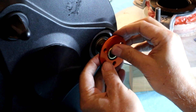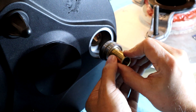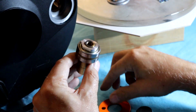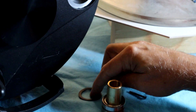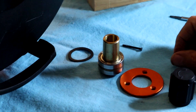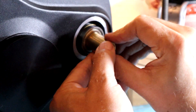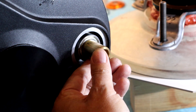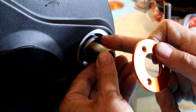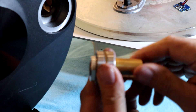First, let me disassemble this. You take out the plate that holds it all in place, pull out the nut after you unthread it from the threaded rod on the mirror. As it comes out, you'll see there's a rubber gasket in the back. This rubber gasket introduces the ability for some play in the focusing mechanism. As it turns out, the bearing height here has a 0.3 millimeter interference with this plate.